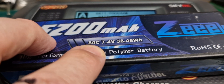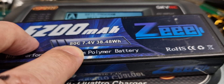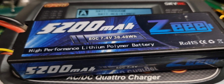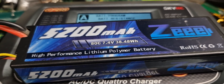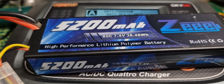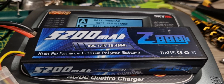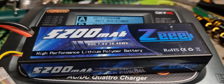There is a formula for working this out — a guy called Robbie's RC has done a big article on LiPo batteries which I recommend everyone reads. It's very interesting when you look at the resistances. I've had no bother with my ZEE batteries. Back in the day when I used to race, we would match NiCad cells for the same discharge rate so you'd have a pack that would last your five-minute racing heat in the brushed motor days. If you're looking to get the most out of your speed controller you need a higher C rating and low internal resistance.